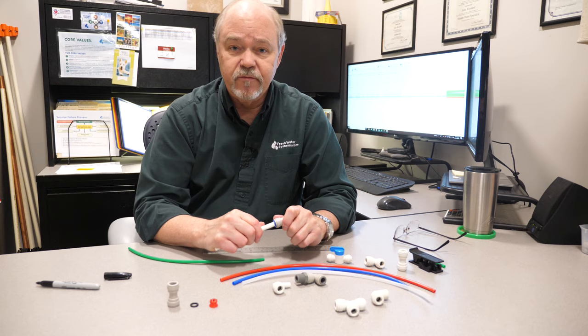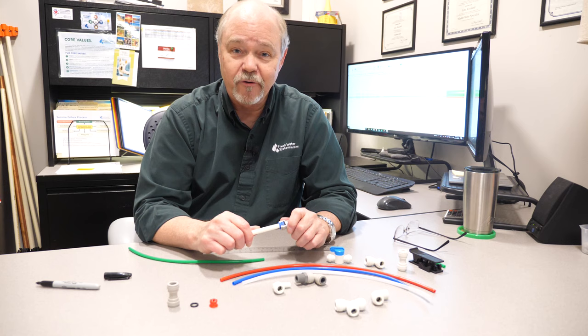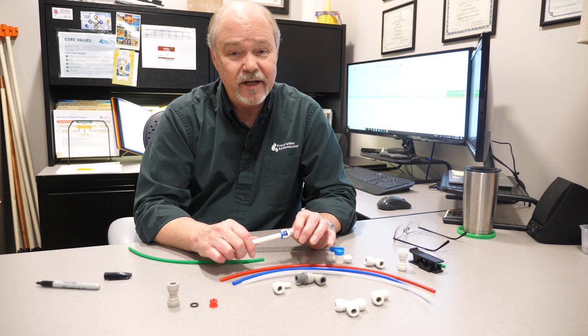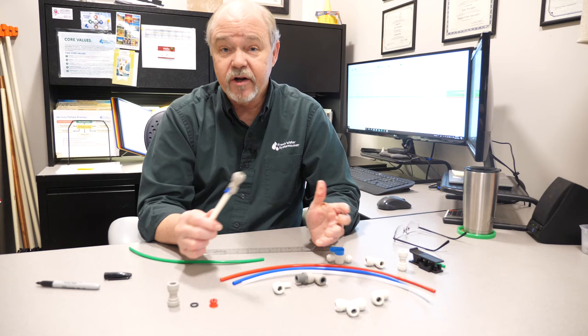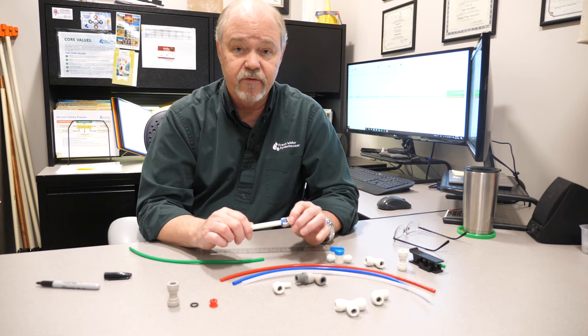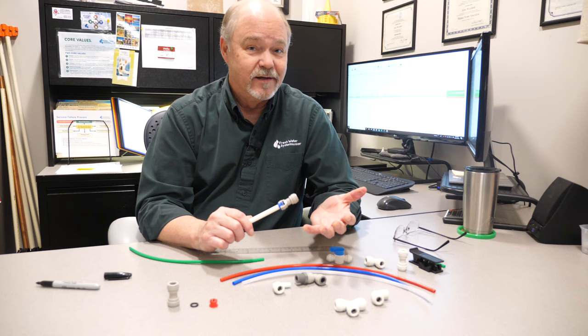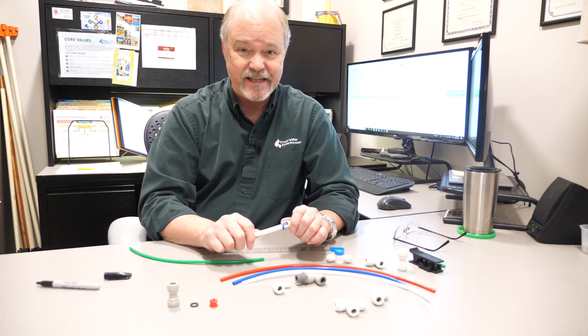If you do those simple things, these fittings work really, really well and they won't leak. In all the years I've been working with these — coming close to 30 — I can honestly tell you I've never seen one that was defective from the factory. They are so simple and effective that when they do leak, chances are something occurred: either you didn't get the tubing into the fitting all the way, or there's a scratch or damage to the o-ring. There are a lot of different manufacturers of these fittings, and this is true of every one of them — they work in a very similar fashion and are affected by the same things. The same basic rules of good practice apply to all brands.